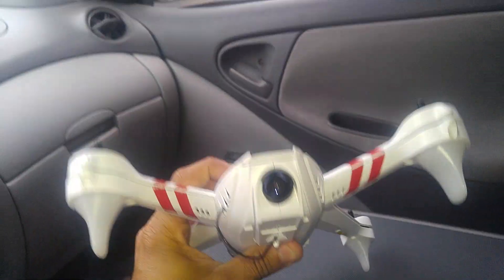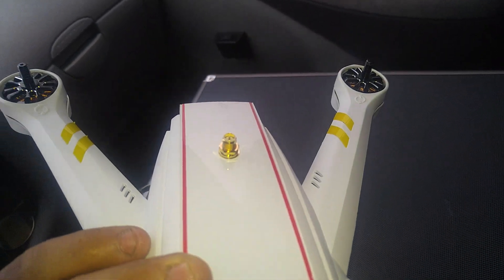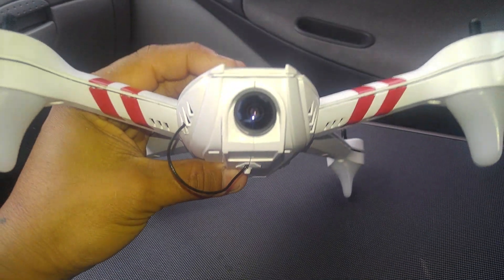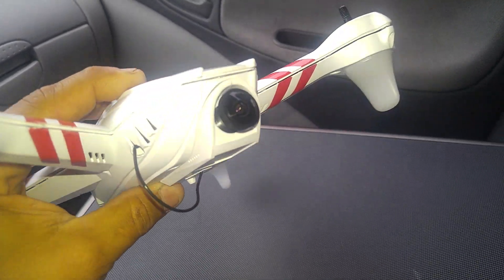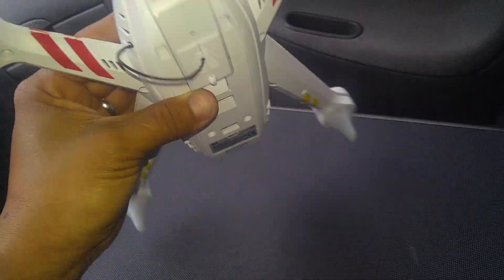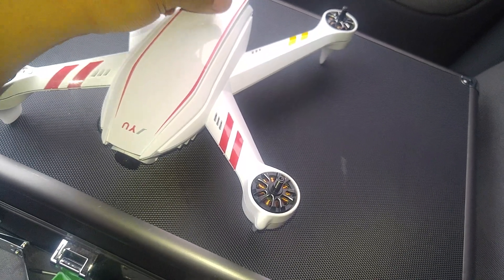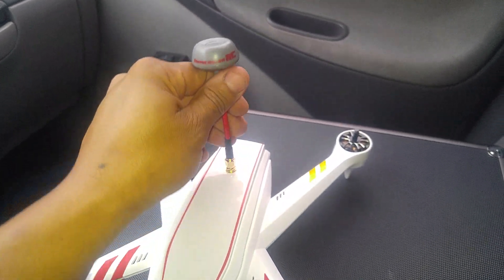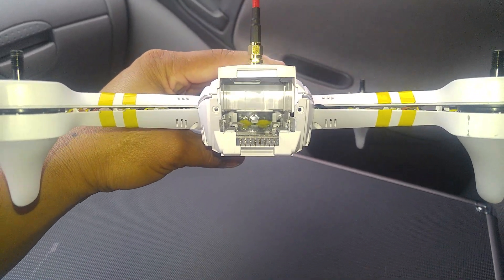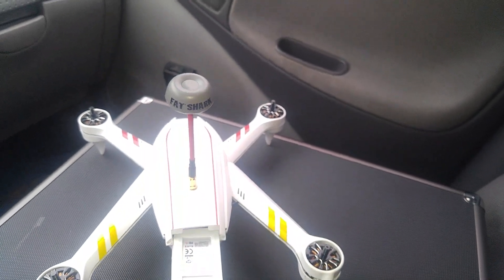That's how it's going to look with the cable outside. Again, this is a 12-inch cable — SMA to SMA connector, 90 degrees, to a UFL connector. I also modified the lens: I took out the original lens and I'm using a GoPro lens — it's sharper. But that's my antenna modification on the JYU for the transmitter. Now you can use any of your antennas.